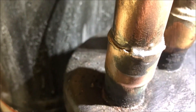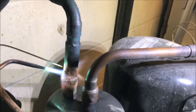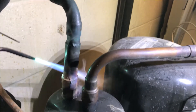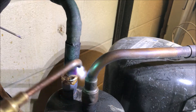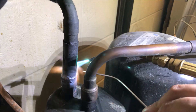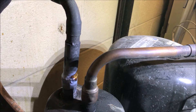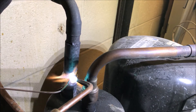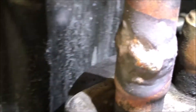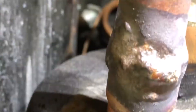I've cleaned this up with a wire brush on my drill, and you can see the little hole there. It's really tight to braze here — obviously during installation they didn't braze all the way around. We're going to lay this on really thick. On a walk-in freezer, moisture gets in there and during defrost, the expansion and contraction will cause cracks on these welds. So I always put a really thick shoulder on a walk-in freezer when brazing. Not the prettiest weld, but that thing is never going to leak on me. Nice and thick — we're good there.